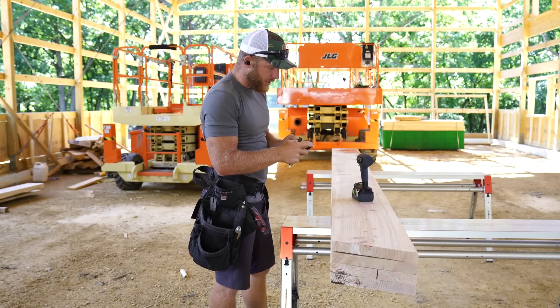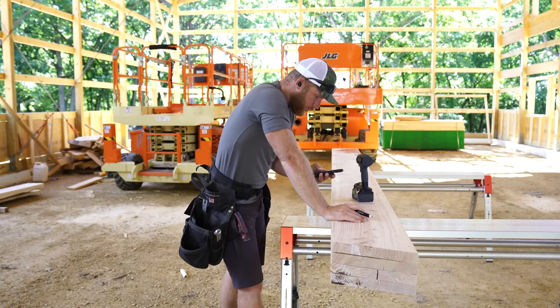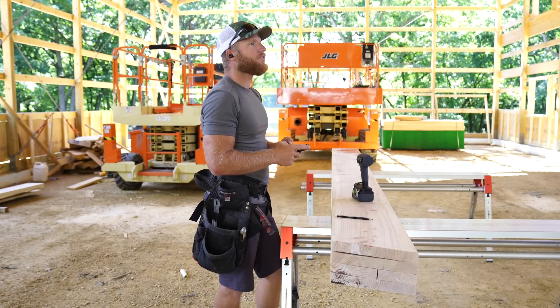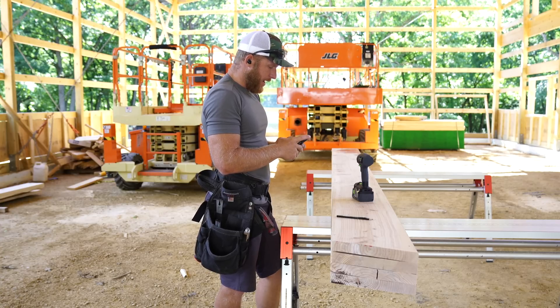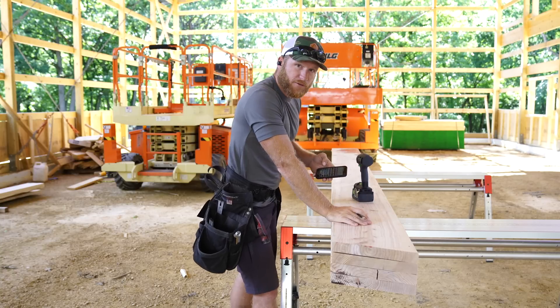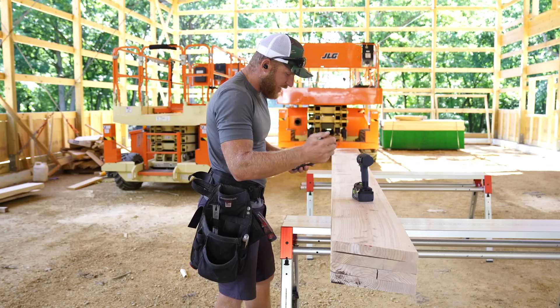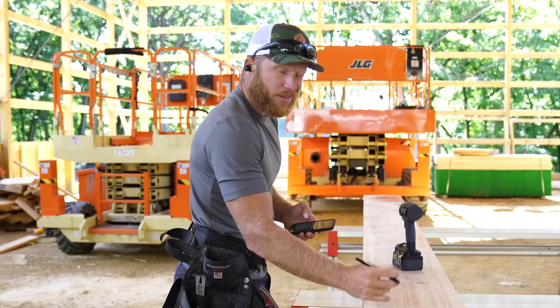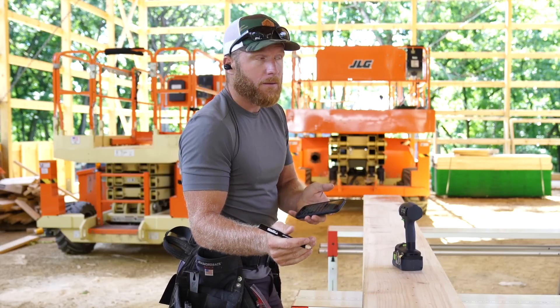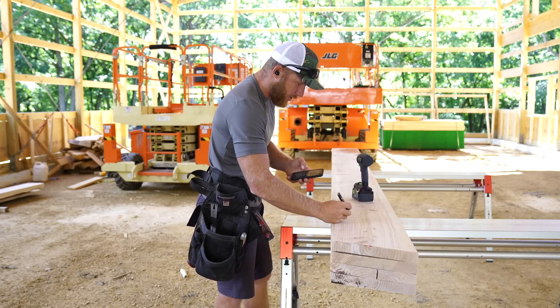I'm going to go four inch pitch and that's going to give me my new run. That does not make sense — oh, I think I used the wrong dimension, that's why. Stupid Kyle. Four inch pitch, my diagonal is three and eleven-sixteenths. Yeah, okay, that's why — I was confused there. I've got this all figured out now. It's going to give me a run of ten foot fifteen-sixteenths, so I know where to mark my framing for this rafter to sit, and I'm going to cut them at ten foot seven and a half.